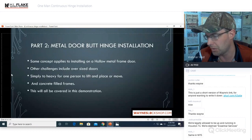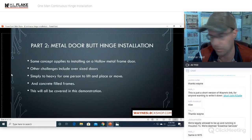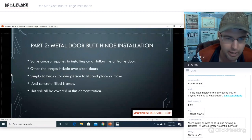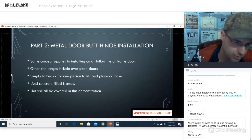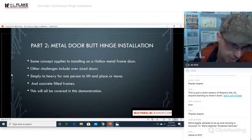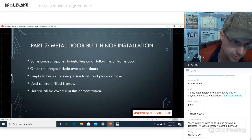Was the door closer on the full door a surface mounted closer or an overhead concealed offset arm closer? I have done both. The one in the video that we just watched was a concealed closer at the center of the door. I removed that and put a conventional externally mounted closer on the inside. I have done the same thing with the arm mounted closer as well.